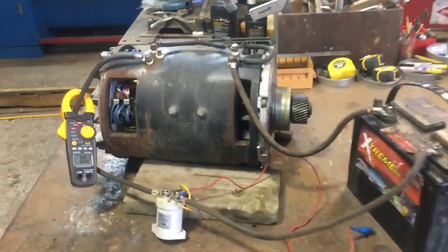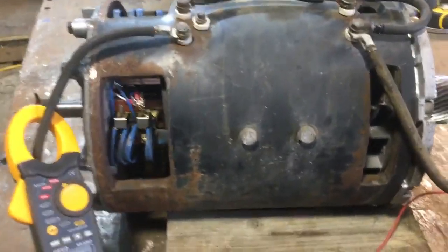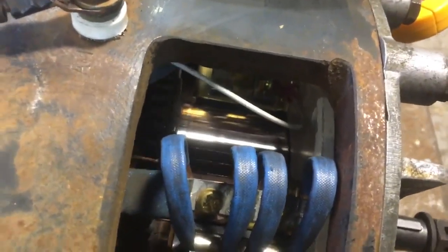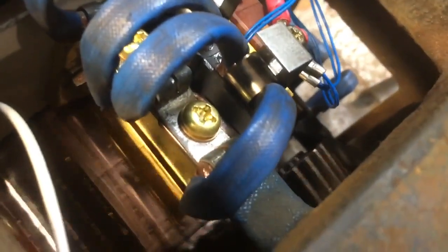The motor is all back together now. The reassembly went fine — it's moderately heavy, but I tossed it on a scale and it was about 80-odd kilos, pretty much bang on 200 pounds all put together. Everything went together smoothly and it spins really nicely with no appreciable resistance or sounds. I've run it a little on this test setup and the commutator is just starting to make stripes adjacent to the corners of the two brushes. It stays well away from the step I had to machine.